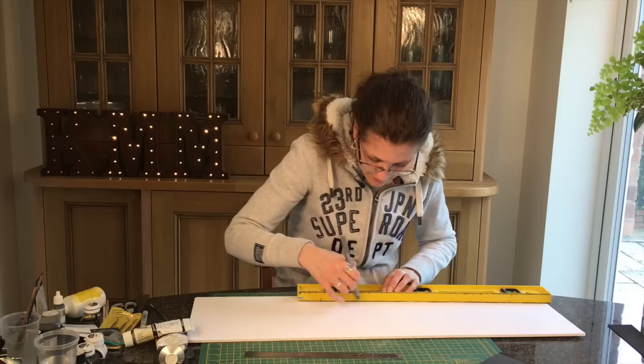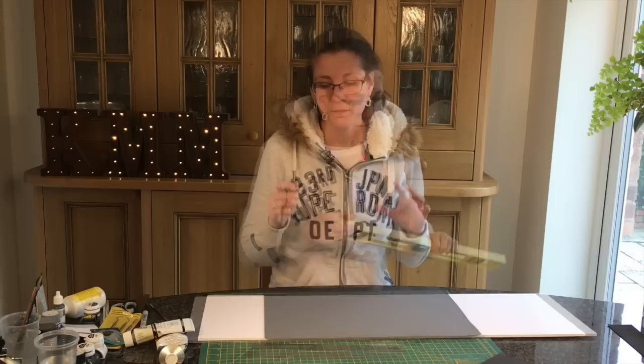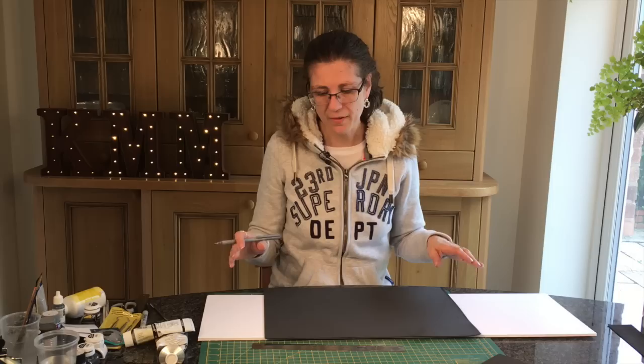And this bit is going to stop about 6-foot short of there, so it comes around a bit. But I also want to put a camber on. And the camber's the bit in the road where the water runs off towards the drains at the edges. Now, I'll do the drains in a future week, so for now, all I need to do is do that camber.